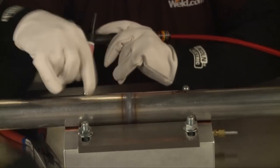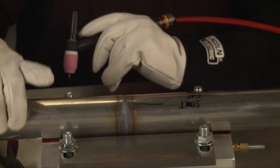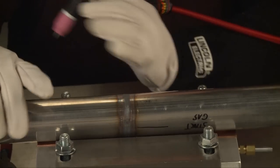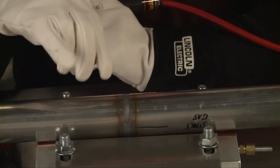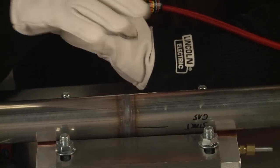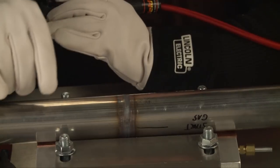Now that we've finished, you've probably noticed that there's a discoloration on each side of the weld, and the stainless itself has kind of a darkish appearance to it. You can do a couple of things with this — you can do a wire brush. If you do a wire brush, you need to do it right after you finish welding because when it's hot, you'll get rid of the oxides off the surface.